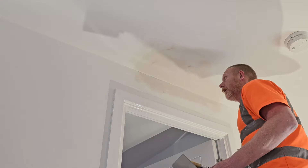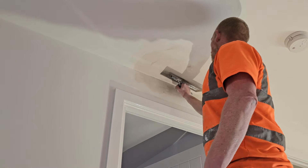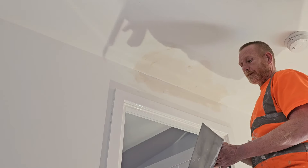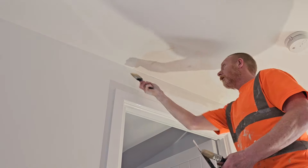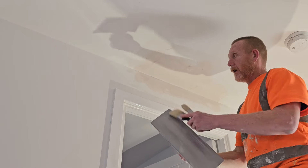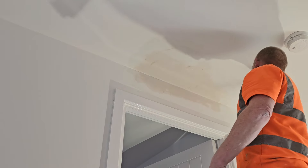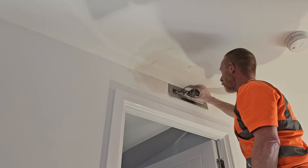Make sure I've got a decent clean trowel with moisture on the blade. We've done our first pass on that ceiling. I'm just going to take this brush, make sure the edges are still nice and clean and fine, then get another pass — come across, coming down, making sure I travel into that edge every time.